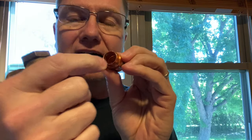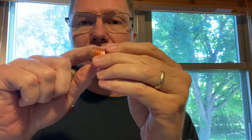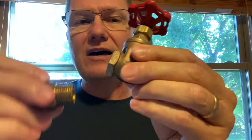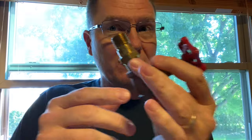That type of fitting is used in a lot of different applications. Say you're going to have a shutoff valve on a toilet — this particular end has a sweat connection, so you'd put your half inch copper inside, clean it out, and solder it on. Once it's cooled off, you wrap Teflon tape on and mount your valve. On the other end you'd also have Teflon tape. This is actually a check valve here, so water can go through it one way but not the other.